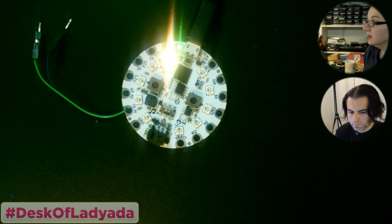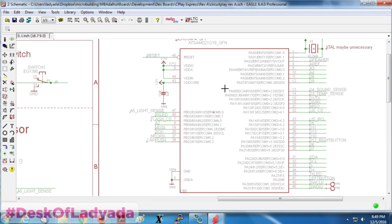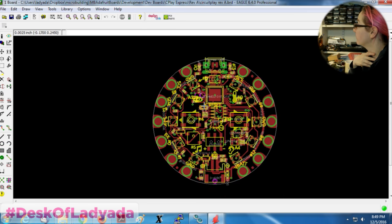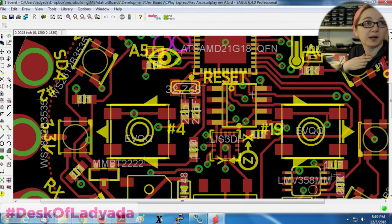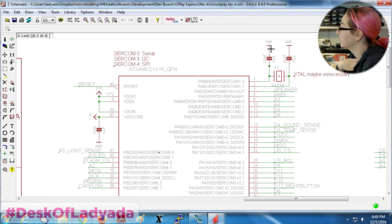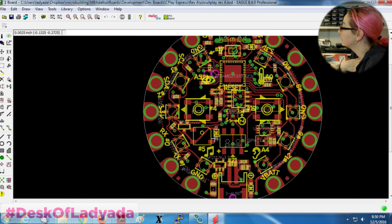So I'm going to go to my computer, and I have to basically go through and write the demo source code that I wrote when I first brought up the board. I've already decided a couple of things I'm going to change with this design. I'm going to change a bunch of the pins around. For example, right now the accelerometer and SPI flash share the same SERCOM, and I don't want to do that anymore. I'm going to create another I2C SERCOM. I can even do that on the crystal pins because this SERCOM is available. So instead of having the accelerometer on SPI, I'll have it on I2C. I'll get to that later, but I could start by just getting the LEDs, switches, piezo, temperature sensor, all that stuff up and running.